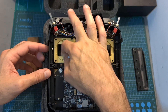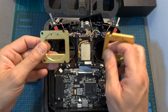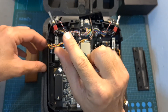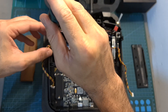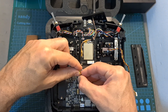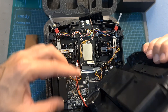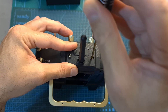To complete the installation of the new gimbals, remove the metal frames from the radio controller, place the new gimbals in the correct orientation, and secure them using the same Phillips screws from the older gimbals. Then reassemble the left and right sliders, connect the JST connectors of the new gimbals to the main board in the same manner as before, reconnect the back speaker to the main board, and reassemble the back cover.